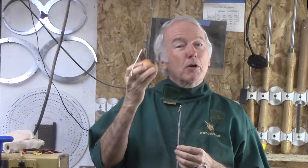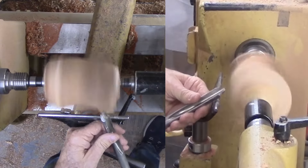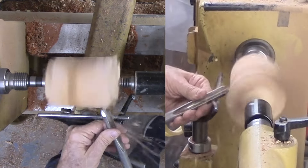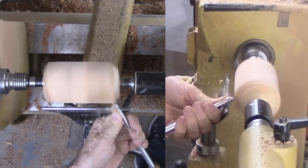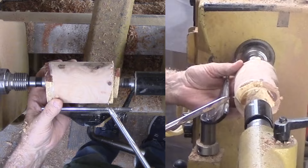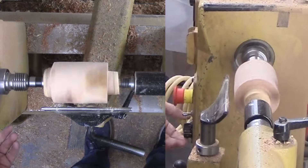Meanwhile, we're going to use the octagon method to cut a perfect sphere and hollow. For this project, I grabbed a chunk of apple that has been drying for a couple of years. It seemed to be enough for a sphere, but since the ends were cut at weird angles, I glued on some end pieces and tried to make them parallel — well, not quite. Now mounted between centers, I can round the wood into a cylinder, and almost without thinking, I cut a tenon on the end.